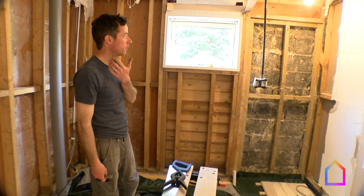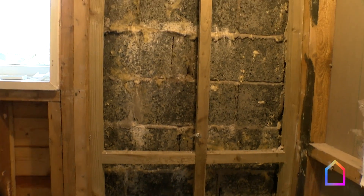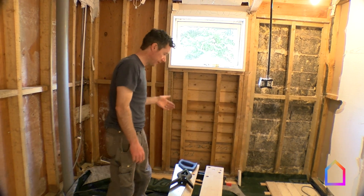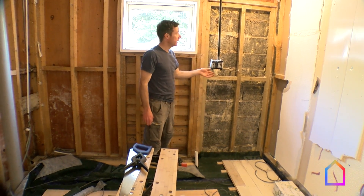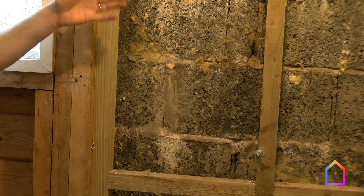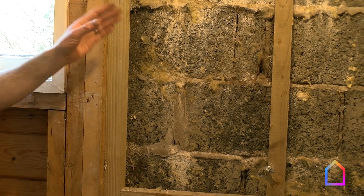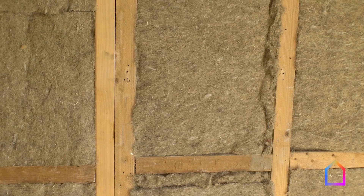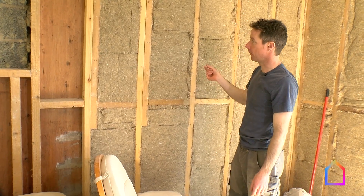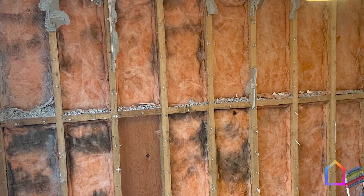We discovered quite a lot of pretty badly done work. This bit here used to be a doorway — at some point it was filled in before me. The way that a timber frame works is that you want a ventilated cavity between the block work and the timber frame, but they just filled this with insulation flush with the block work and didn't reinstate the ventilated cavity. So that got really damp, with lots of black mould and plants growing in it. These are 100mm deep studs, and previously there was just about 10 or 15mm of glass wool insulation in there, which had loads of mould because air was leaking into the structure and condensing.